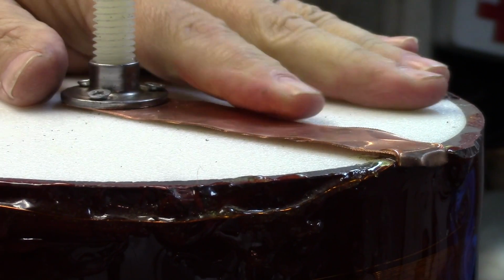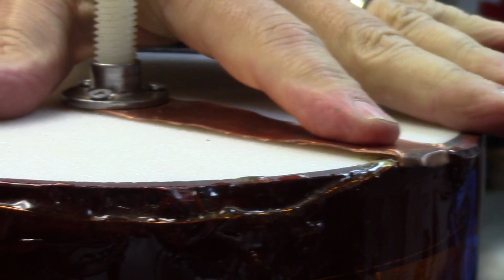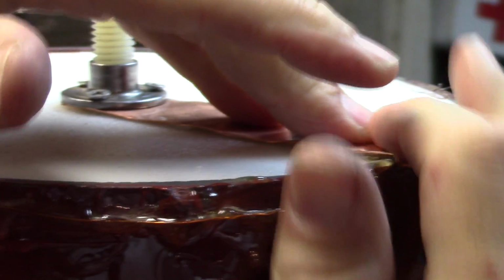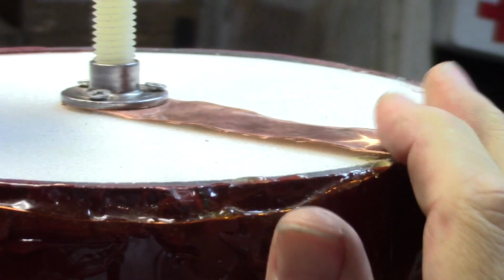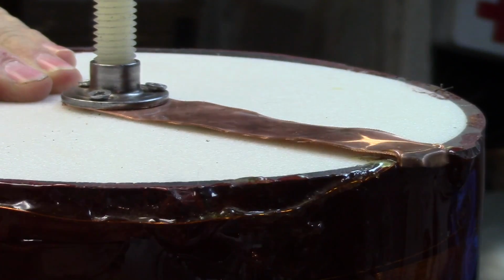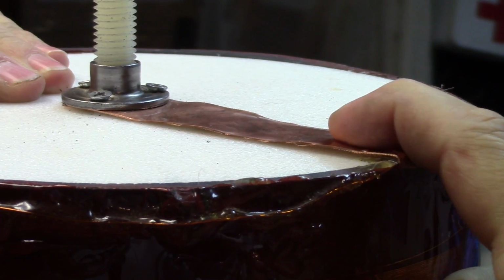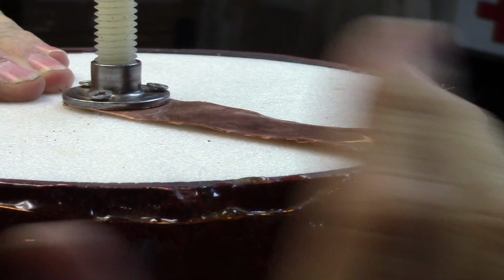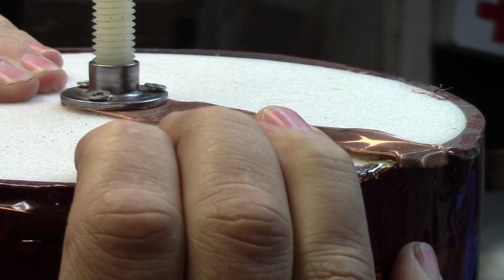And then this is one of the first secondaries I built. I would probably not do it this way if I was going to do it again. I'd more efficiently probably just put a copper plate here, because the problem is this wire tends to break. As long as this copper piece moves at all, it'll break off from the wire, despite the fact it's epoxy down there.